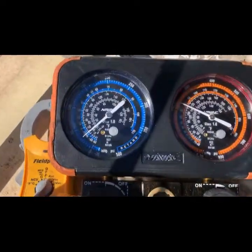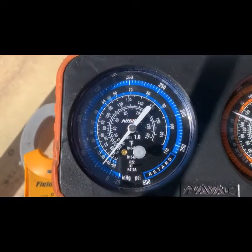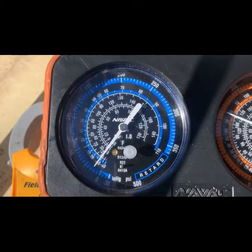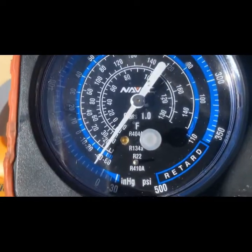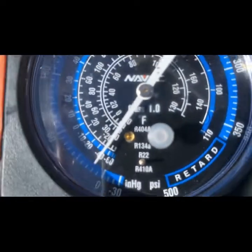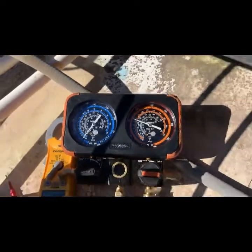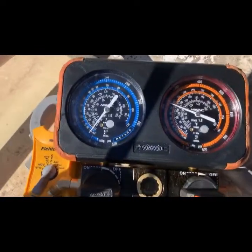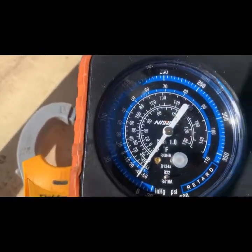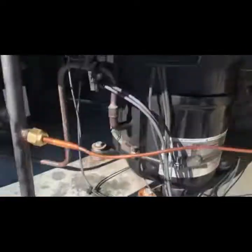Now I truly want to let it satisfy and make sure the pressure controller cuts it out at 10 PSI. We wait — it should be pumping down right now. Bada bing — that sucker is calibrated! It should have shut off right at 10 PSI. When the solenoid opens back up that'll go to 60 or 70 and we'll be rolling. Pressure switch replaced.